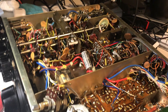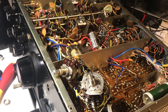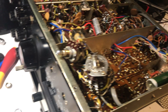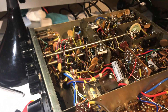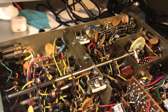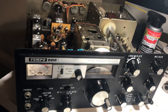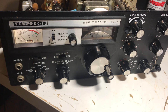I couldn't get this radio to transmit, but I could receive on all bands. 40 meters was wonky though — I kept picking up 8.998 MHz frequencies on 40 meters and I could only hear 40 meters faintly. On 40 there are no real coils; you tune these two capacitors, which is odd. I was tuning this capacitor here and it started arcing over, so I turned the radio off. Terrible. Anyway, this radio has been sitting around, and I thought, let's put the transmit relay back from this radio into this one and see if I can get it to work.